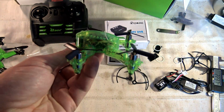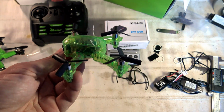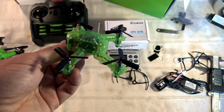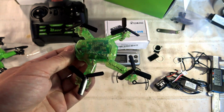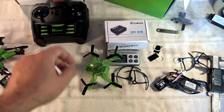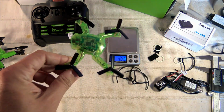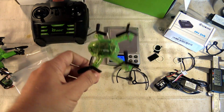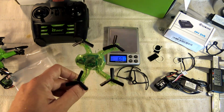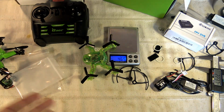In fact, you can connect it to Betaflight, but I will immediately mention that you cannot upgrade this Betaflight version, and moreover, only a few elements are really available to change their values. For example, you can change only the PID values, that's all, and you can also monitor the first 4 channels. You cannot, for example, monitor the extra channels for the angle mode, etc., for the aux1, aux2. You cannot monitor them directly, so they probably installed some protection, okay, to avoid flashing a bad Betaflight version, etc. So can we regret it? Maybe, but it clearly means that this new version is more targeted at FPV beginners who want a first machine, especially if you take the full bundle with the mask. So at least you cannot make any mistake. You just, if you want, adjust some PIDs, and that's probably the most important.